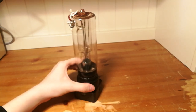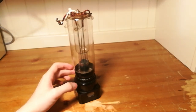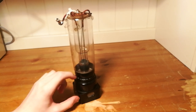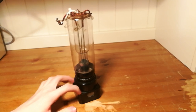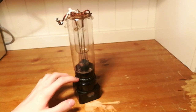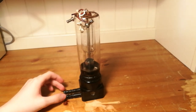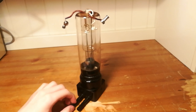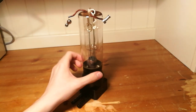The minority of emissions will probably be in the vicinity of 10 to 20 keV in energy. It's a pretty interesting tube — it gets hot pretty fast. When I'm running it at 200 to 400 watts, it can survive maybe 30 or 40 seconds before it heats up too much to be safely run anymore. When cooling it, you want to pump in about 6 to 12 liters per minute to successfully cool it enough to run pretty much as long as you want, if the liquid is pulling enough heat away.